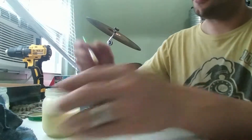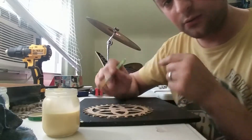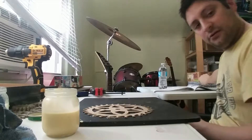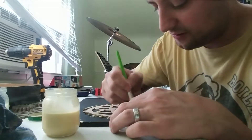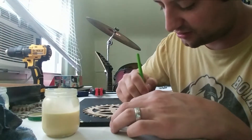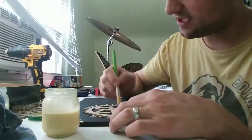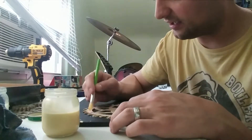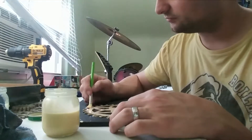Two more for this gear. When I'm done gluing a gear, the big ones I put under the tiles — I've got three in there being pressed right now, they've been in there a couple of hours. The glue sets in 30 minutes it says, but really it takes overnight to harden. I'm not going to do anything more to those gears today until they've had a chance to harden overnight, so I can Dremel the teeth and lacquer them without worrying about further warpage.